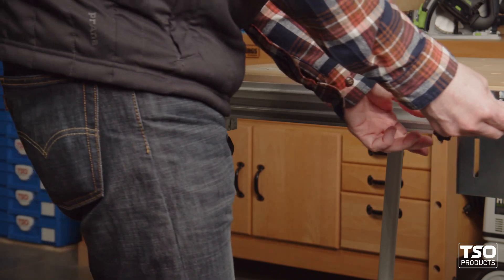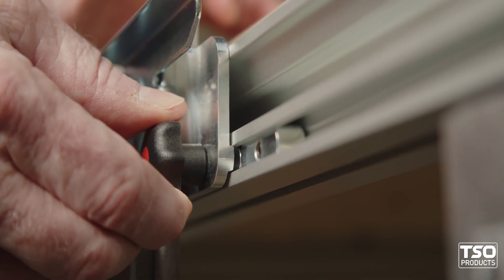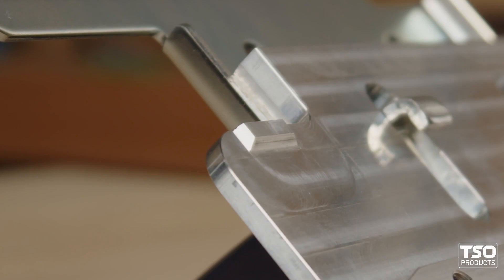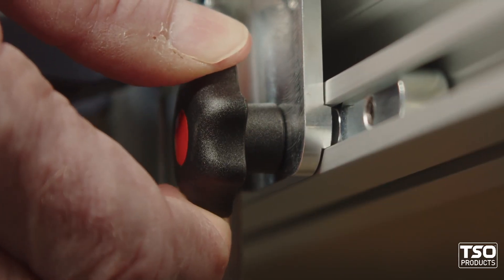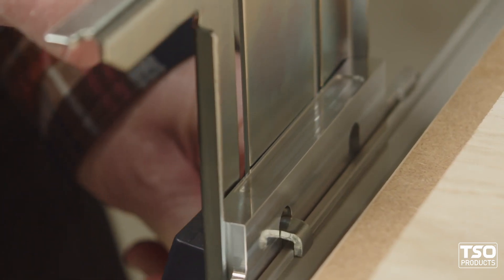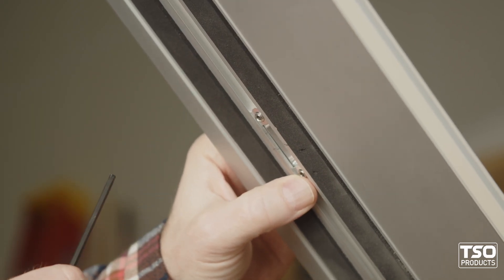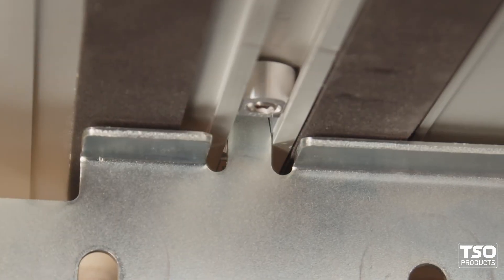To improve the reliability of the MFT3's guide rail, the MFT-Aligned Upgrade Kit utilizes a rigid aluminum support plate with two knobs and multiple beveled protrusions to firmly attach it to the table. The new aluminum support plate is machined for a closer fit to the sliding metal support, which also helps to limit unwanted movement. An aluminum guide rail locator is also included to minimize lateral movement of the guide rail and further improve accuracy.